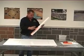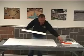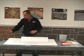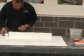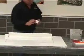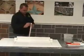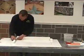And we're just going to take, now I've skipped a couple steps on you guys. I'm going to show you this at the end. But we're just going to take that protective layer that was on the PSA tape, the red tape there, affix it to our foam, and stick it down in place. Now this is a 2 1/4 inch drop down edge that we're doing, when our casting deck is actually only going to be 3/4 of an inch. Again, these are the higher thickness as well. Again, I'm being sure to place that protected edge of the foam on the inside of my mold.